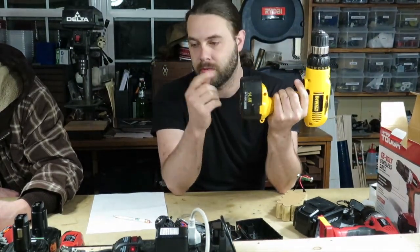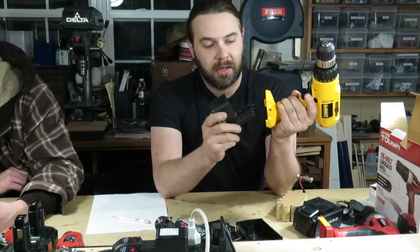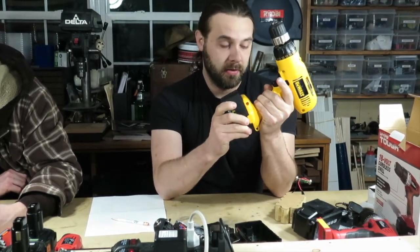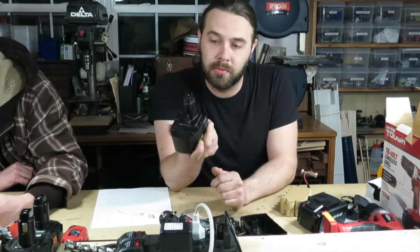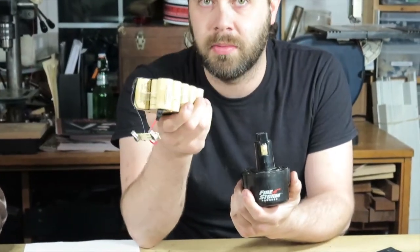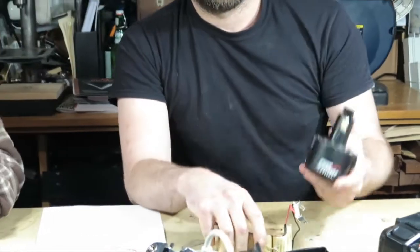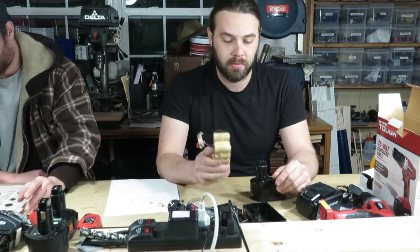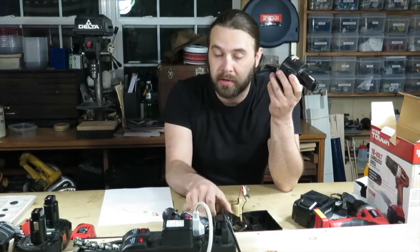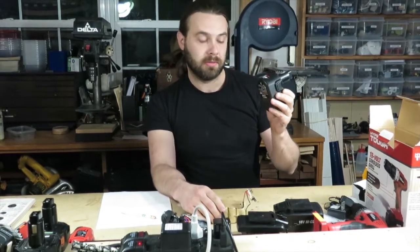As we do here — we've got some 14.4s, some 12s, some 9.6s. And as you can see, this is actually a Black & Decker battery; you can modify it to take DeWalt or Black & Decker batteries. This drill is working great, but this was a battery that would not hold the charge anymore — maybe 10 minutes. What I did: I took these batteries, clipped them apart, reoriented them in the correct fashion, soldered them back together, and rebuilt this battery.